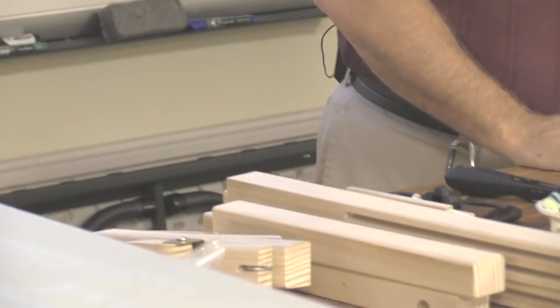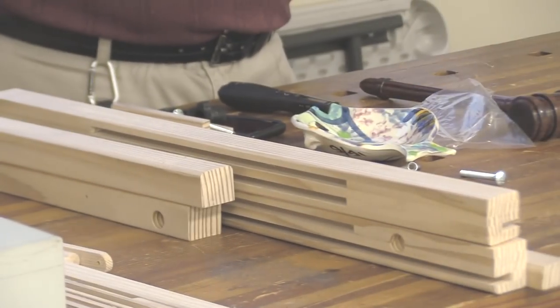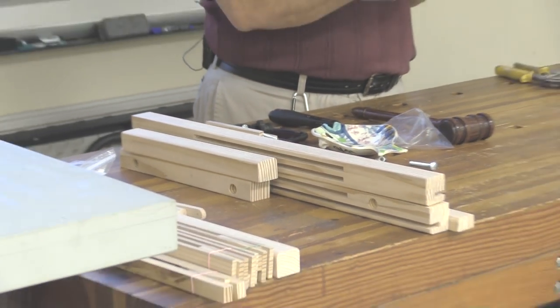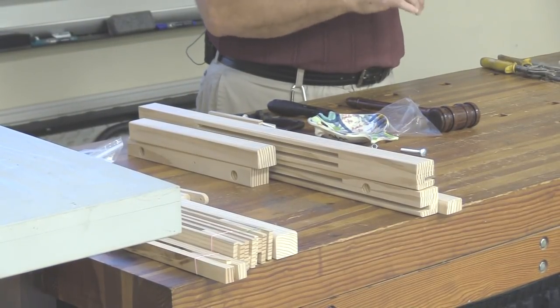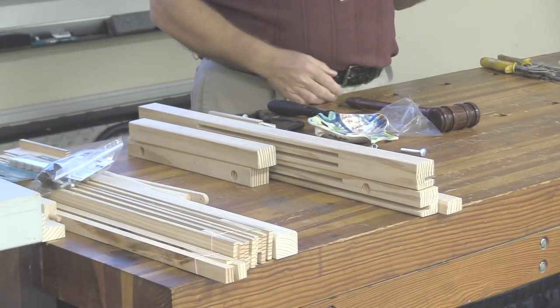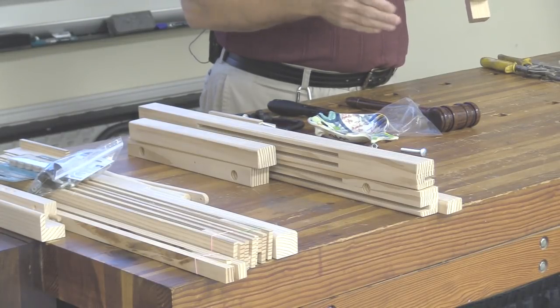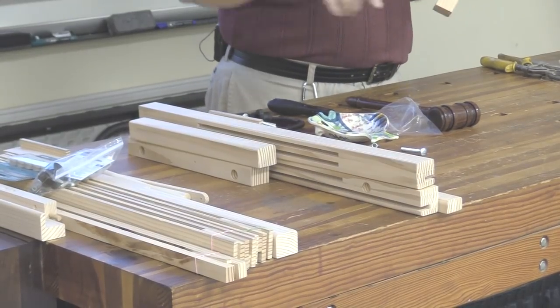There's the entire materials list, and you don't need the hinges if you want to make your own hinge at the bottom. I'm going to pass this around, which looks like some sort of ancient torture device, but it's got a larger version using that eye screw on here, so you could use that as a hinge at the bottom. It's got another version of that. It's got a hinge version, and a lot of times on the back of an easel, where you want to stop it, you use a chain at the bottom or a sliding stop like that.